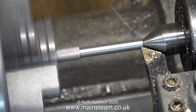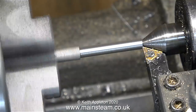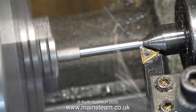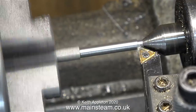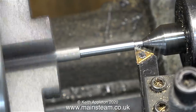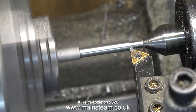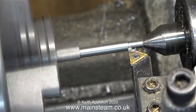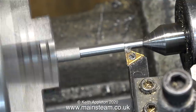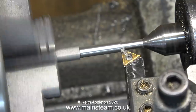It's important to take micrometer readings very close to the chuck. Currently, because the piece of steel is still quite thick, I can take fairly deep cuts, but in a short while the cuts will be very fine indeed. Attachments for lathes come in the form of fixed and travelling steadies, but when I bought this lathe I didn't get any of those, so I don't have any means of supporting the work from behind in the center. I could make some sort of improvised jig, but in the time it would take to make and fit it, the job will be completed.